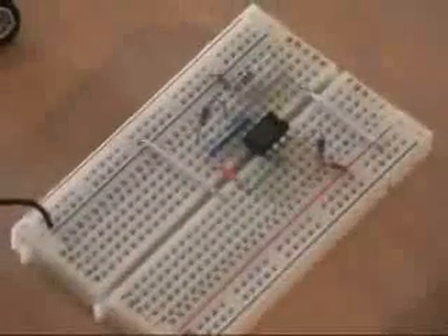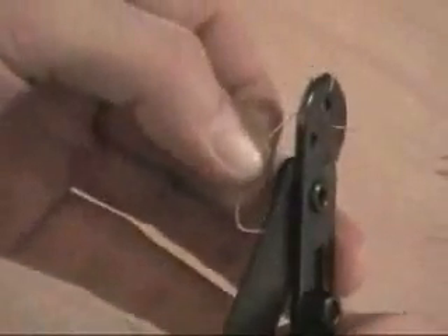The next resistor will be the 39 kohm resistor, which is orange, white, orange, gold. This one has a little bit longer to travel, so I'm not going to cut it at all — I'm just going to put it in place. E2 to positive. I'll put it into E2, just like that, and bring the other end over to the positive. I can always go back and shorten this — once I've figured out my length, I can simply pull it back out, cut some off, and put it back in. E2 to positive. Now we have that resistor in place.